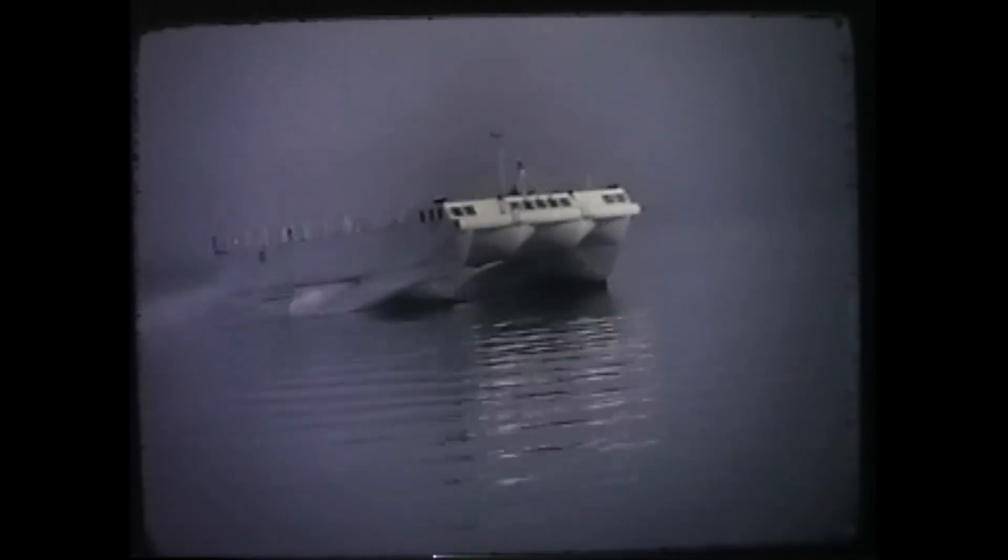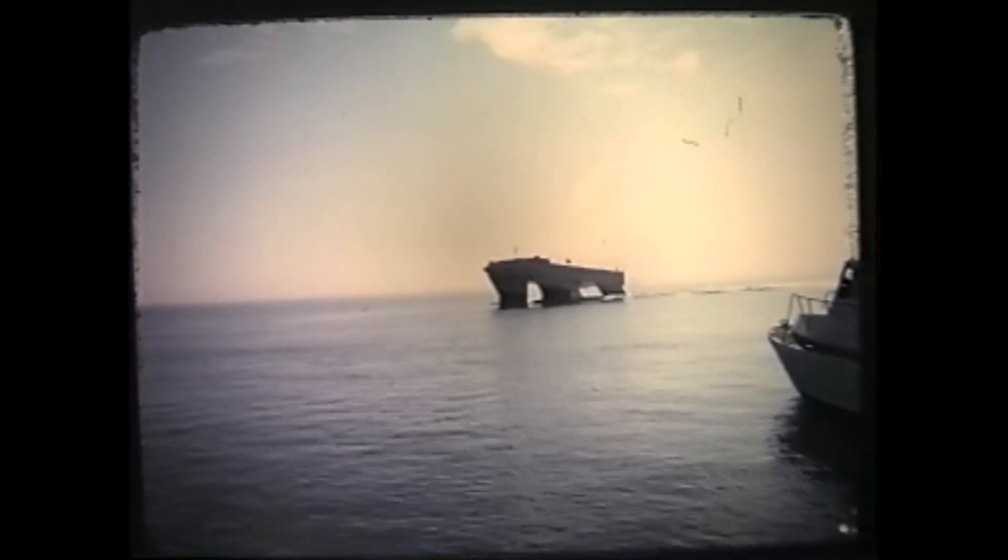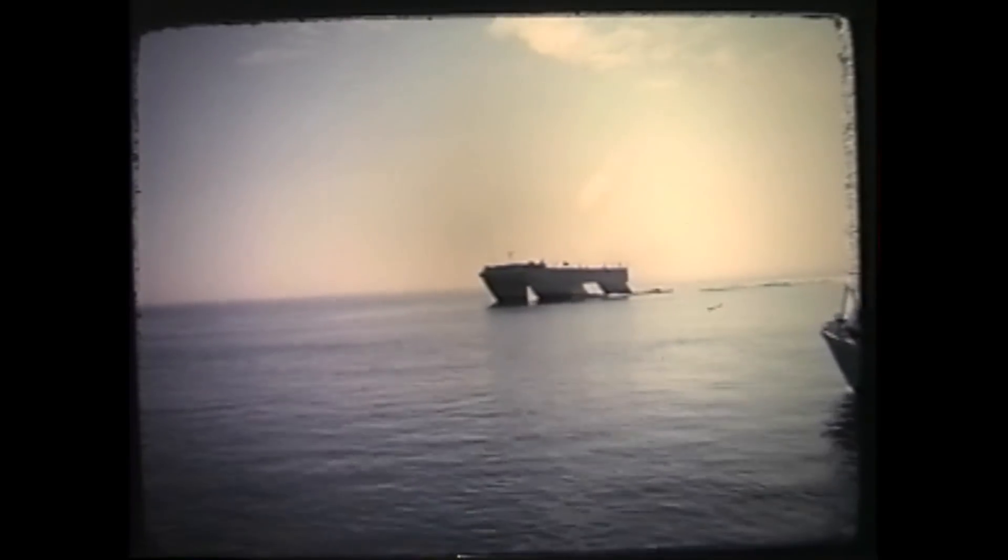Unlike hydrofoil boats, the main hull remains above water even when at rest. The model reacts to canard deflections to induce pitch, and the full-scale SSP reacts in a like manner, although four times slower due to the difference in scale. The canard control fins are being moved hydraulically, showing the strong dynamic control over motion which is possible.